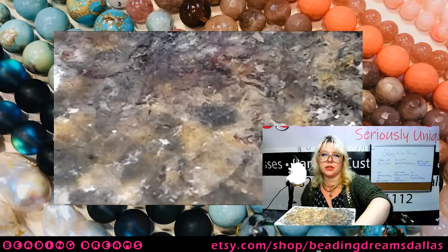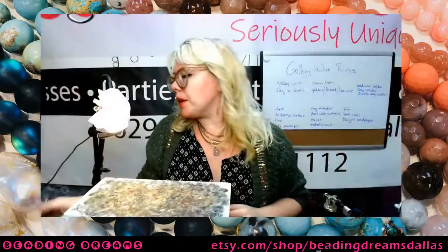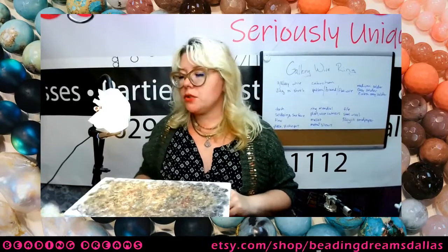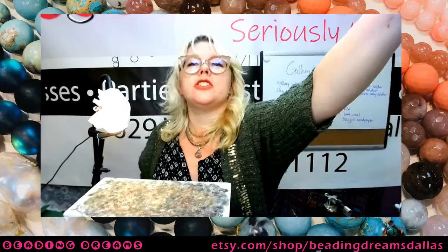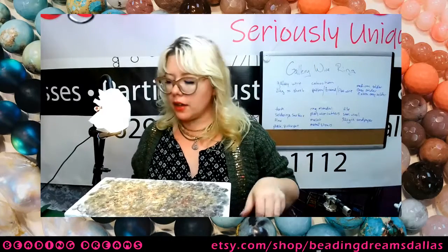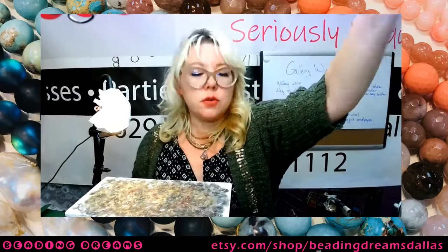And it's the time in the stream where I talk about pickle. What is pickle? What does it do? Pickle is a weak acid solution. And its job is to clean all of that junk, all of the flux residue, all of the oxide, all of the everything gross off of your piece so that you can do one of two things.